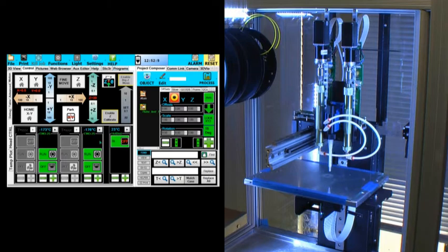On the screen where we have these two heads, I'm going to scoot over 3 clicks to the material flow rate multiplier on the overrides page. And if I wanted 60% from slot 2 and 40% from slot 4, I would just dial this guy to 0.6 and this guy to 0.4. And when I start my job, that's how we would do it.